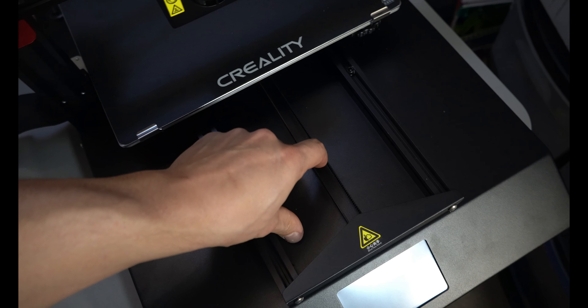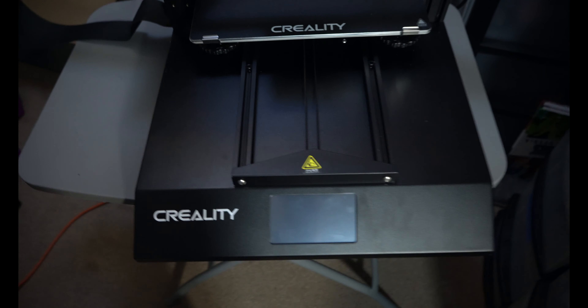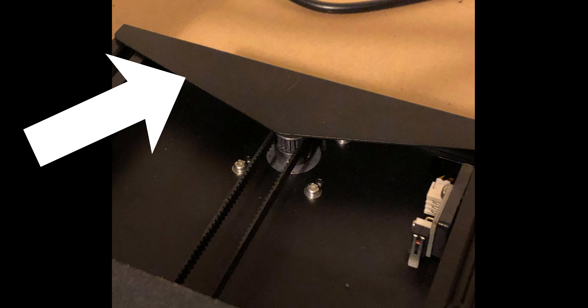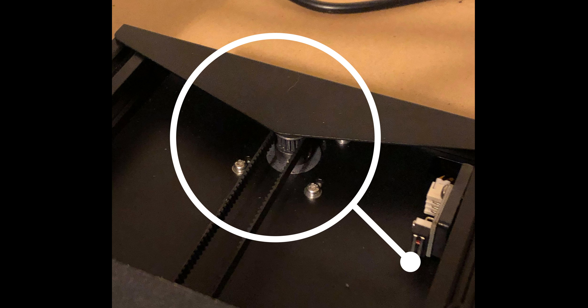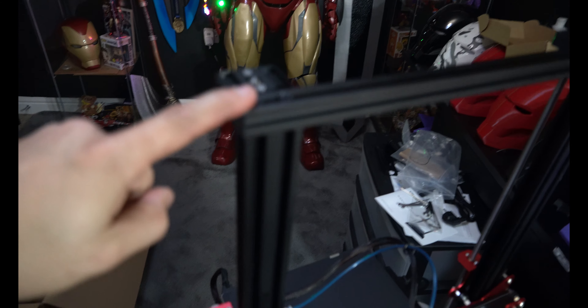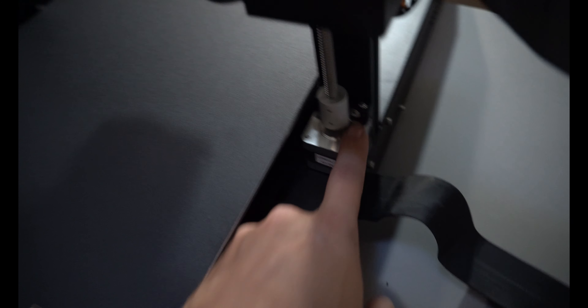Everything looks really good. I don't personally like how tight this belt is on the bed, but we'll see. While I was editing this video, I've had my CR-10S Pro running for a few days now and the belt is too tight. Behind the bed there's a little triangular metal cover — pop that off and loosen those four screws to release tension on the belt. What was happening: the belt was too tight and it was starting to get chewed up. It doesn't need to be guitar string tight. Also go around and tighten all the screws and bolts around the printer, including the screws holding the stepper motor to the rail. Just snug everything up — it's only going to pay dividends in the end.